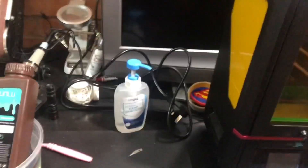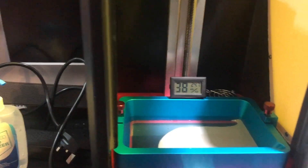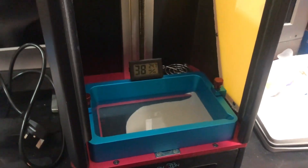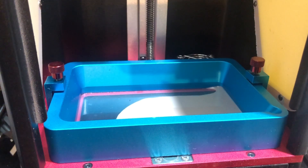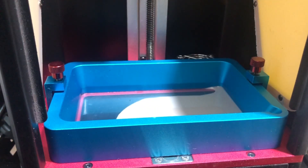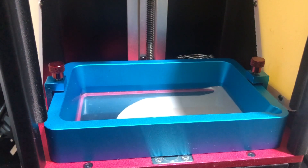I left it soaking for a few minutes — the temperature inside has dropped a little to 24 degrees because I was opening the enclosure, but that's more than enough — it's hotter than the garage. I'm using Sunlu water washable resin, which is very good for post processing — I'll leave the link in the description if you're interested. Always shake your resin bottles before use. Now I'll pour it into the vat.